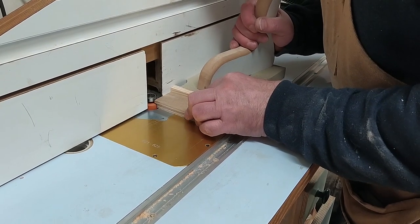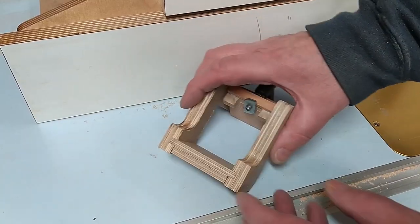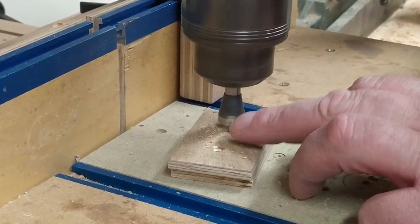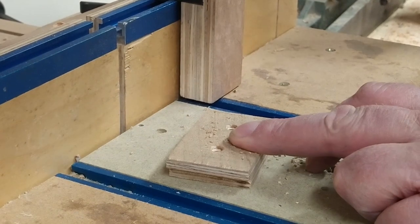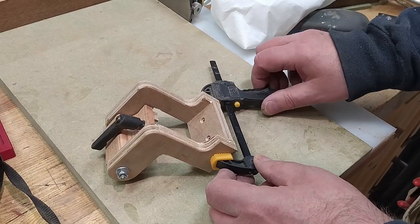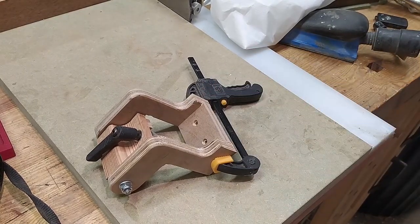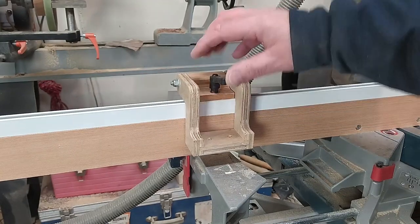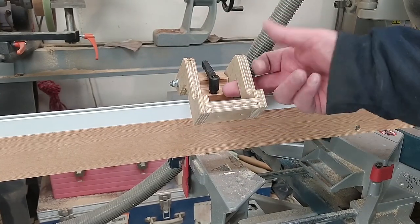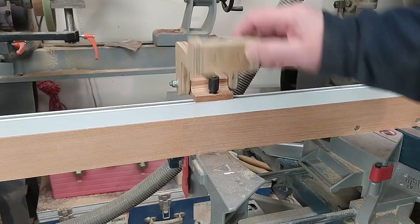After shaping the sides, I've routed a shallow groove near the bottom end, and the bottom piece has corresponding tongues routed — that's going to glue up very nicely, and then this can just be trimmed off. I need two mounting holes for the sacrificial stop and it's easier to drill for these now than after glue-up. Mechanically this is finished — it slides nicely, locks in place, and the flip stop is not fouled by the Bristol lever. Even when the cursor is installed it won't foul, and similarly the Bristol lever doesn't foul on the flip stop itself. The only thing is it looks a bit grubby — this is very old plywood from a bookcase that my dad made, so it could be 50 years old. It might even be older than I am. I might paint it.